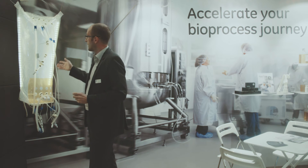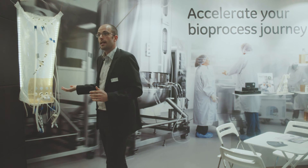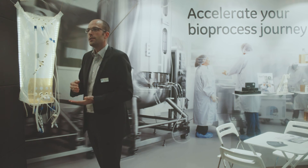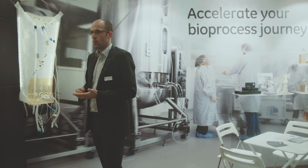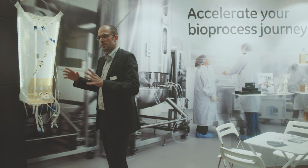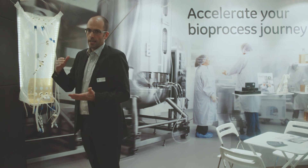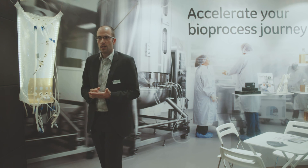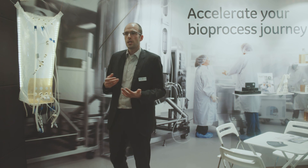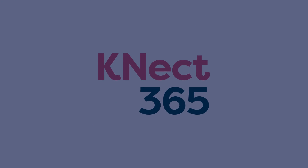The 50 litre system is also our small scale system for full scale fermentation. The biggest available single-use fermentation system on the market is the XDR500MO microbial system. It's a brand new system that covers all the special needs of fermentation, including extreme high cooling capacity and the 1 VVM gas flow rate needed for sufficient oxygen transfer rate.